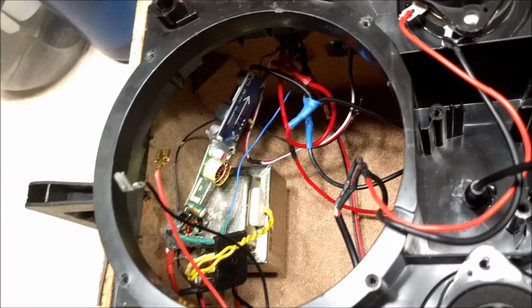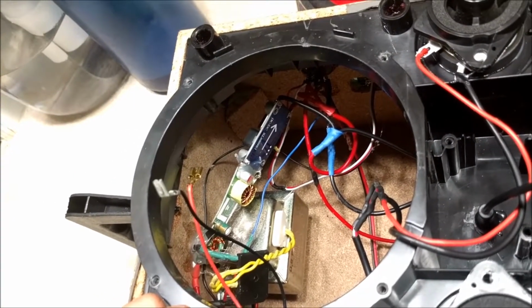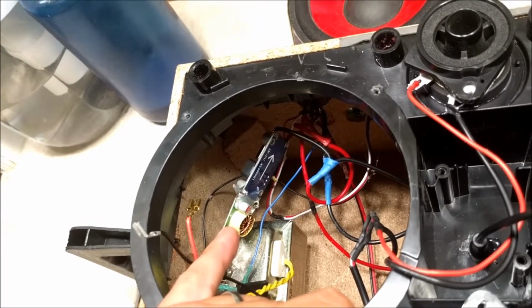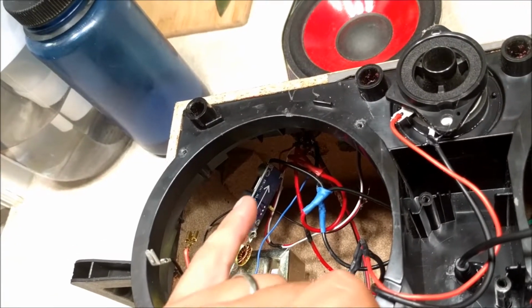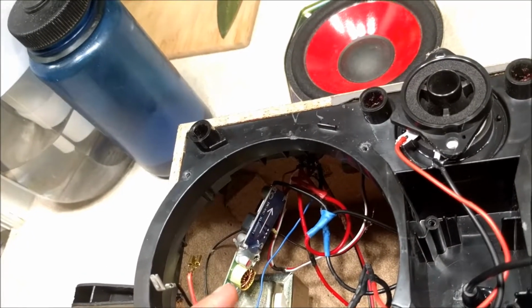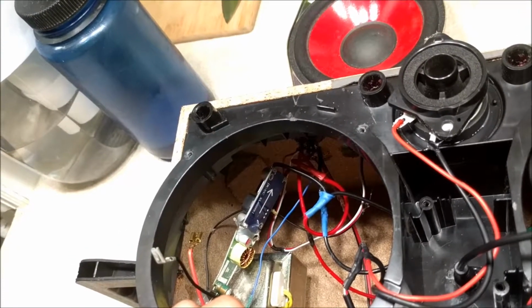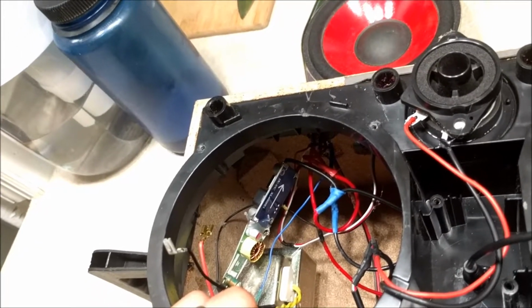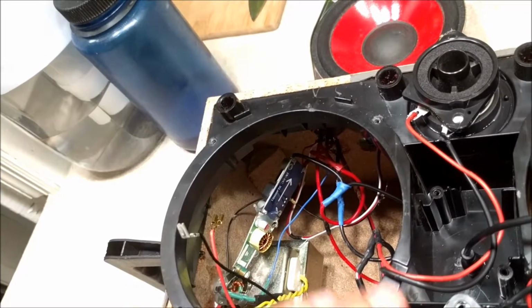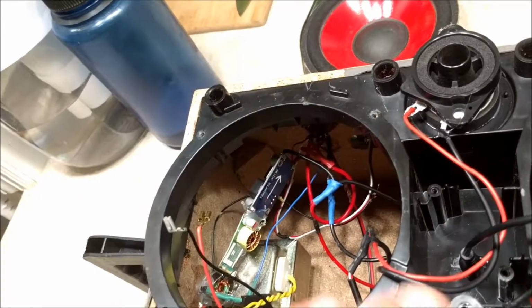I've put in a little rectifier, which you can see right here. And from there, it goes to a USB charger for your car. So 12 volt to 12 volt to 5 volt step down converter is kind of what it's doing. And then that 5 volts is being fed directly into a boost converter, because if I were to directly attach the boost converter to the input source here, it wouldn't be able to go as low as I wanted it to; it was reading like 16 volts was the lowest I could set it. So with this, it goes all the way down. I don't know how far it goes down, but I was able to set it to the 13.5 volts that I wanted, and so that's how this is all being powered.